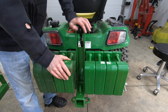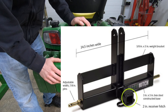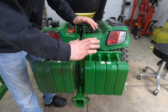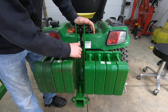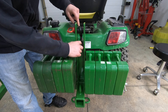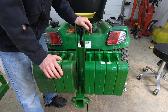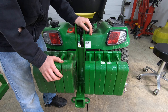When it came to the design of the heavy hitch, I'll put a picture on screen of what I found online for dimensions. The one dimension I couldn't find anywhere was the width between the two pieces that make up the top link. The dimension I came up with from the inside to the inside is two inches — if you go two and a half, the inner weights won't fit and you'll only get three weights per side instead of four. The other dimension I couldn't find was the height of the center plate: on my design it's four and a half inches from the top of the plate to the center of the pin. I don't know if that's quick-hitch compatible since I personally don't own a quick hitch, so it may or may not work.